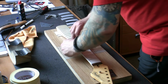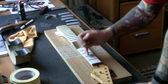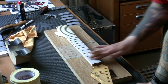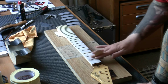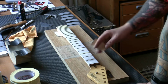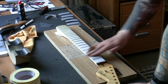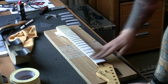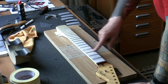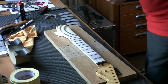Now I'm just doing this to show the camera. Once I've done that, I'm also going to go just across the top first run, because we put scratches in this way. So with the 400 grit, we're going to start to remove those scratches, and we're going to be quite coarse, but it's going to give us a head start for when we get to the finer grits. So I'm going to soften the edges of the bevels. First run, we've already got rid of a load of them scratches, so it's going to make the job a lot easier down the line.